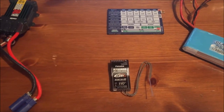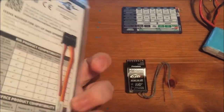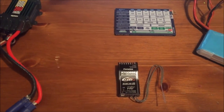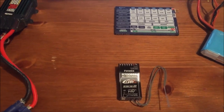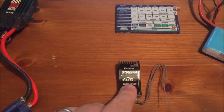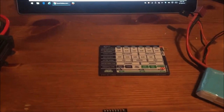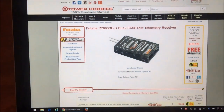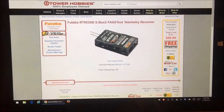There are two versions of the telemetry link available. This is the SBUS2 version for Futaba. There is a newly released version for Spektrum. I've gotten questions about whether it will be available on DMSS and other systems — honestly, that's a question for Castle. To make it work with the Futaba system, you have to have one of the new FASSTest telemetry-enabled receivers as well as a FASSTest-compatible telemetry radio. The 14SG, 18SZ, and 18MZ are all compatible. Also, if you don't want the big bulky eight-channel version, there is a three-channel version, the 7003SB, for a smaller, more compact option.